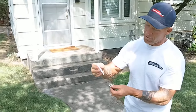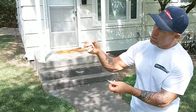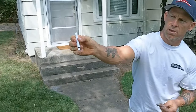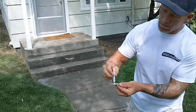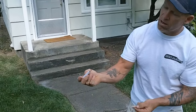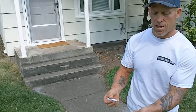I'm going to shake it twice like this, then squeeze gently. You can start to see the yellow liquid come through the cotton swab on the end. Once that liquid comes through, we're going to squeeze and gently rub the cotton swab on our paint sample. If the cotton swab turns pink or red, then it's positive for lead.